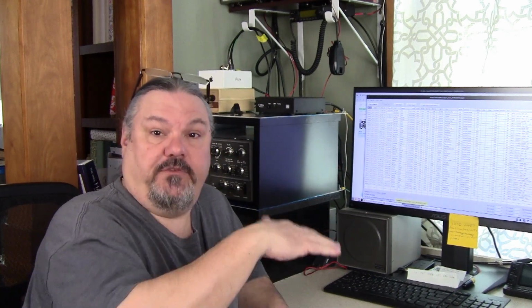And the Linux SDR software doesn't recover very quickly, I have found. When I transmit, even at 50 watts, for example, the SDR software, of course, sees and hears my signal. Even though the antenna shuts off, this is a residential neighborhood, and none of this equipment is separated very much. And it doesn't recover. The Windows-based SDR softwares seem to recover very quickly. That is, you hear your signal come through and see it on the screen, and then as soon as you stop transmitting, you're instantly, or very nearly instantly, receiving on the SDR again.